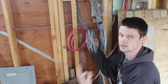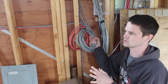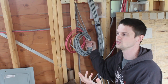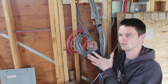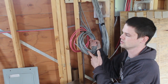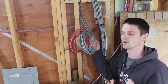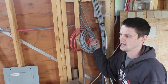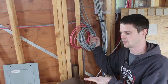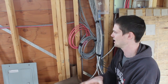We've got some other stuff, and part of the reason is we're going a bit crazy and just adding a bunch of extra wires for things down the road. As the design of this system has evolved, we've been thinking more ahead to the possibility of hooking up a battery bank for 12-volt power and powering more stuff off 12 volts. So we've run extra wires for potential future use. There's one that goes to the toilet room — as we've talked about, potentially having a heated toilet seat might be a fun thing to try, and we'd also have power there for additional fans or dehumidification for the composting toilet. There's also power run there for a foot-switchable valve for the water at the sink, so you can soap your hands up with the water off and then rinse it all foot-controlled.